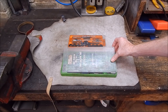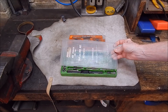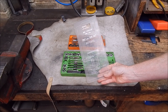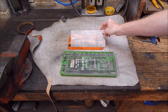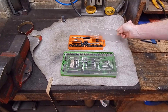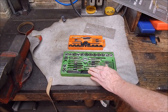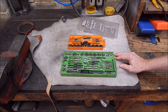Let's look at a couple of typical small tap and die sets that a lot of people would have. I've had these for about 40 years — these are Japanese, both of them — but the Chinese ones are a direct knockoff of this type of set. Here's a 40-piece set with BSW and SAE, and here's a metric set, 20-piece. I use them both. You can see I've replaced on both of them taps that have broken over the years with high speed steel, because in these sets the taps and dies are always high carbon steel.